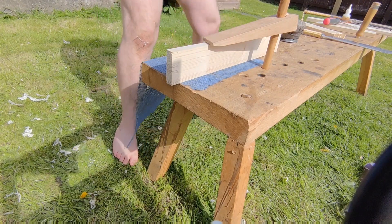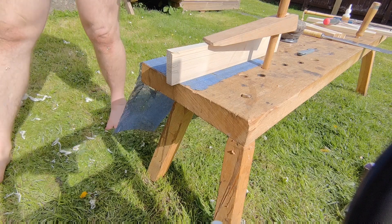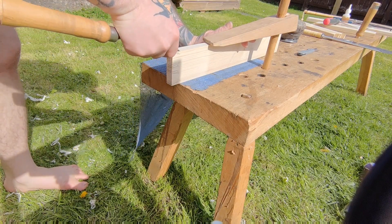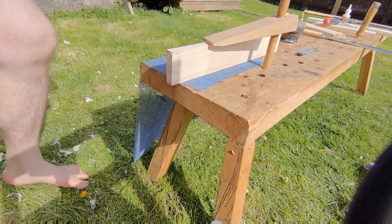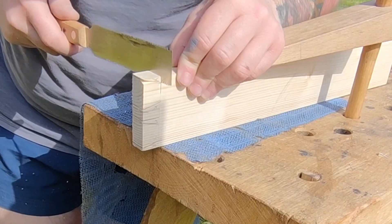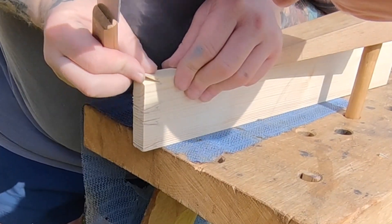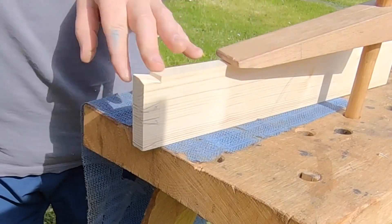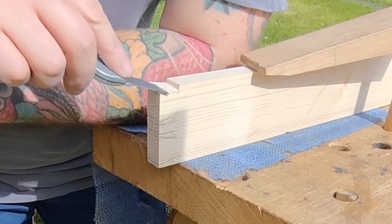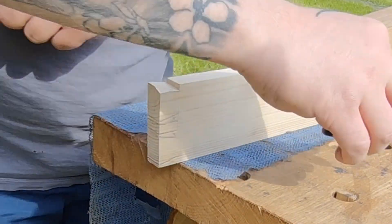Next I'm removing the two outside shoulders — sometimes I do this first, sometimes last. I'm creating a knife valley, and I'm actually using a flush saw here, which gives a really fine cut. As you can see, I've actually damaged the edge of the corner of the dovetail, and there's super glue on the edge of my knife.